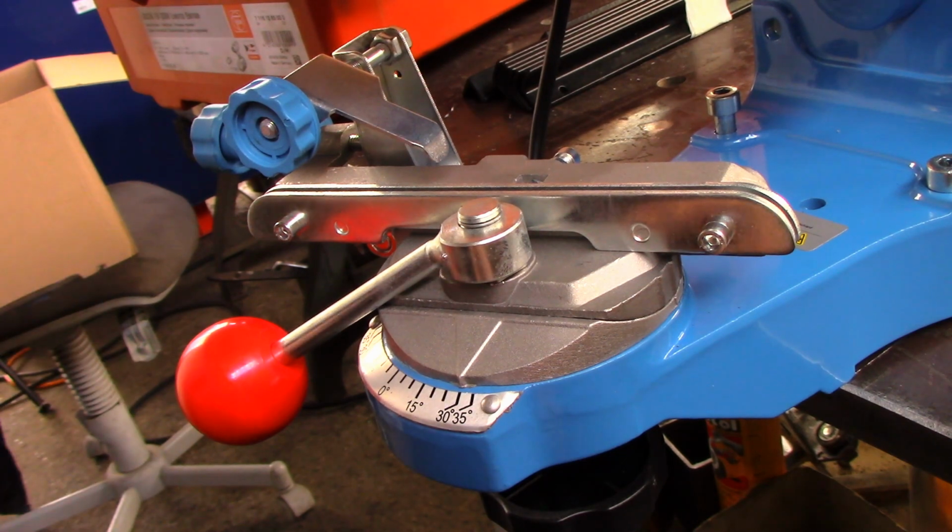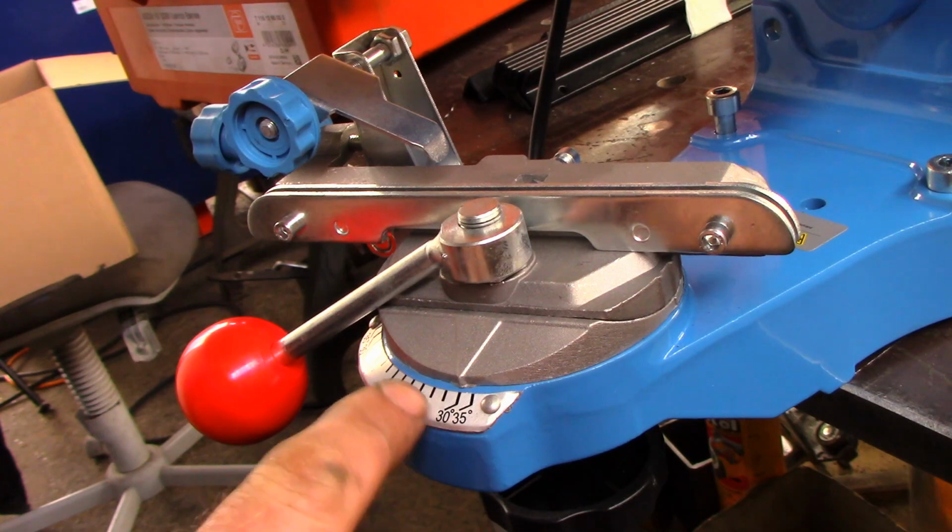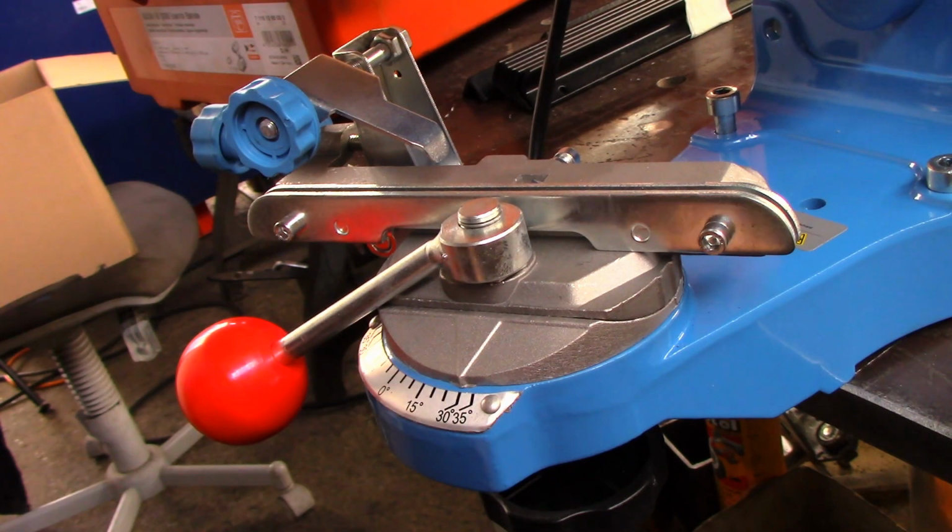That way you can cut just about anything, hardwoods or softwoods. Now if you're cutting exclusively softwoods, you can go to 35 degrees and you'll do fine, but as soon as you go into hardwoods, you'll find that your chain is going to bite a little hard, and you'll just be rattling teeth out of your head trying to get your chain to go through a log.